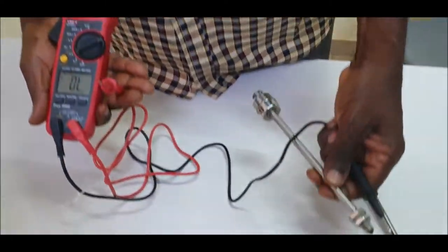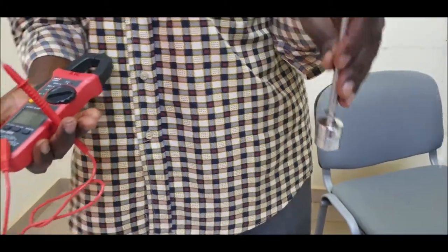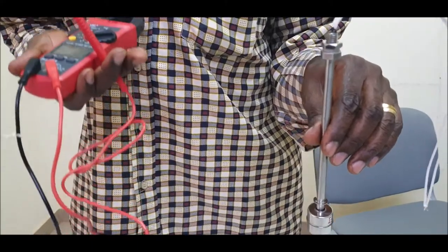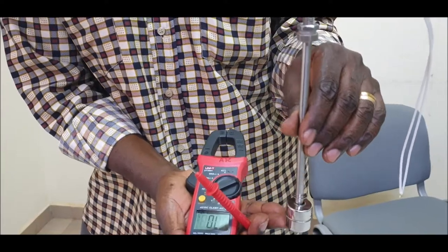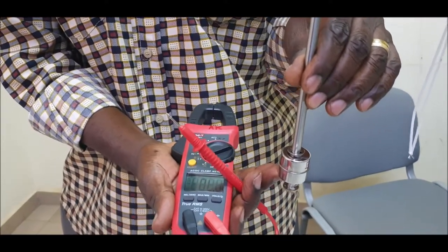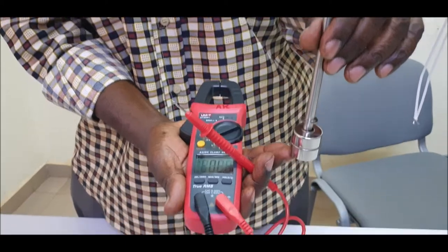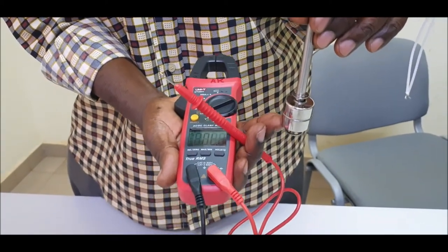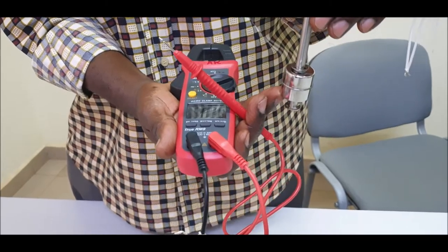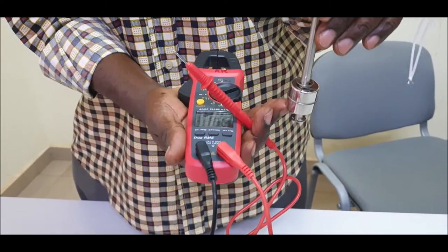Now, I put here A, and this one I've written also B, but at first I don't know which one is normally open, normally closed. Remember, that normally means that the float is submerged with water. So normally open means when submerged with water, the float will move from bottom to top, and in this position no current will be allowed within the float. And normally closed means if it's submerged and moves from bottom to top, there is circulation. If it's normally open, there is no circulation. It's always in reference to the submerged float.